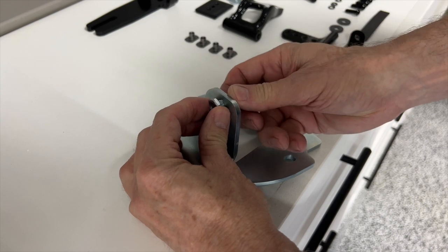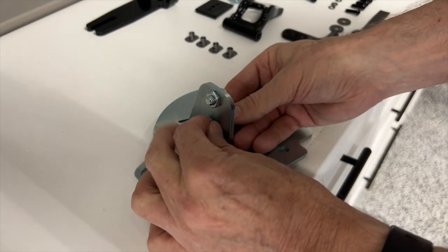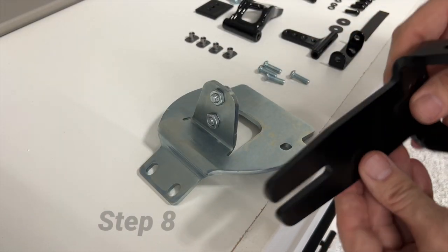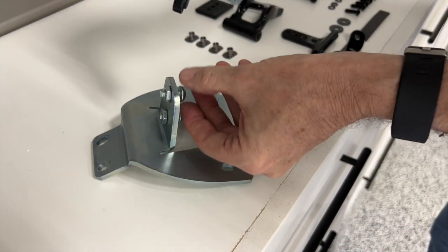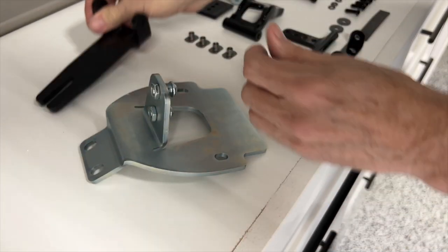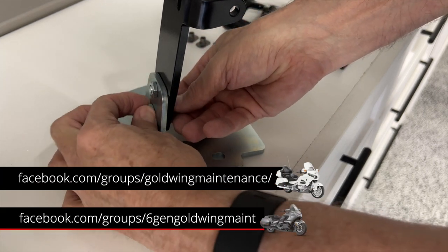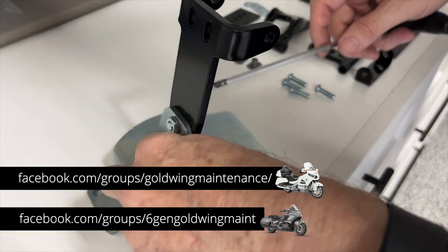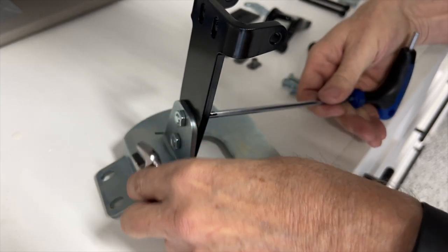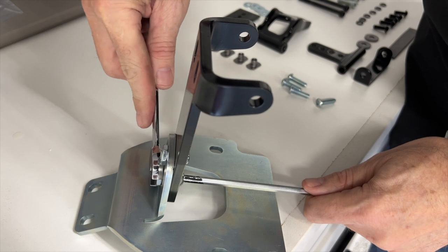Let's install the jam nut on each of these screws and tighten it down. There are two jam nuts available, and make sure you have the screws and the nuts oriented correctly as shown in this video. Before we tighten everything down, we need to make sure that the slot in this riser will slip down in between the head of those screws and the base mount. You may have to back off those screws a little bit — loosen the nuts and unscrew those screws until this slot will fit down in there — and it needs to be a snug fit; you don't want it too tight because you want to be able to remove it. You can leave that riser in place as you tighten down these jam nuts using an Allen wrench and holding an open-end wrench on the nut, just checking periodically to make sure you can still remove that riser.